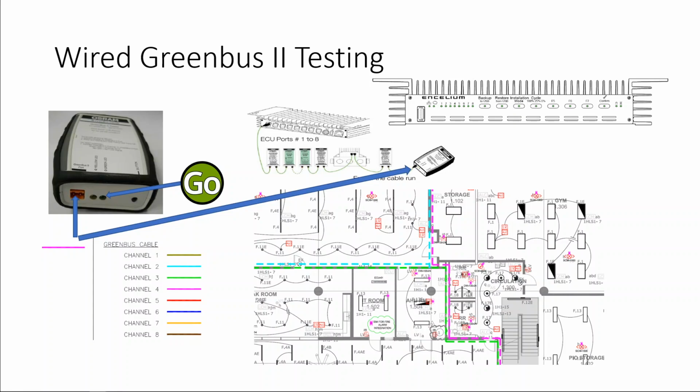The control unit also has a feature to assist in the installation. This feature is what we call the installation mode, and this is what the electrical contractors should be using to test their connections. If the fixtures are dimmable, by putting it in the installation mode and cycling through the various steps, all fixtures connected to channels connected to the ECU should go through a dimming process of 100% brightness, 25% brightness, and off.